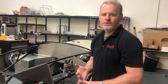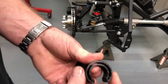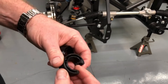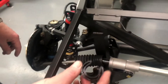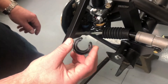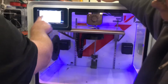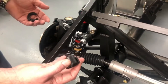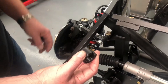What we decided to do was 3D print some steering stops to limit the articulation. We made two different size stops with a gap in the center so that they have some flex. This will allow the stops to snap on securely to the steering rack. We made these out of polycarbonate on the Evo 3D printer. Print time is probably somewhere around an hour, hour and a half for both parts. Material costs maybe on the order of a dollar or so. And we can basically do the whole thing from design to a prototype part in less than half a day.